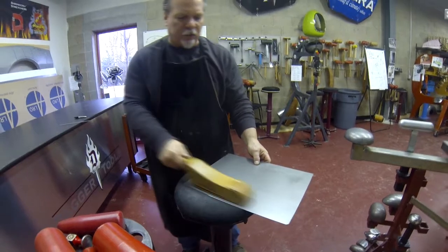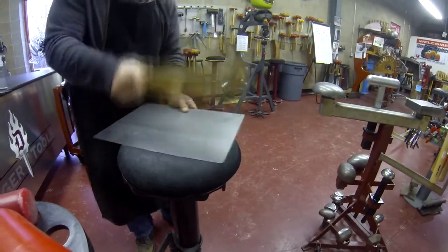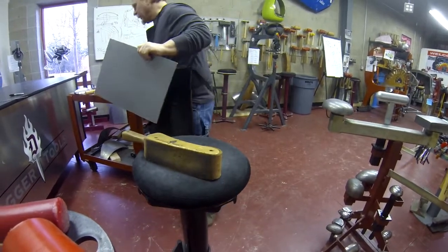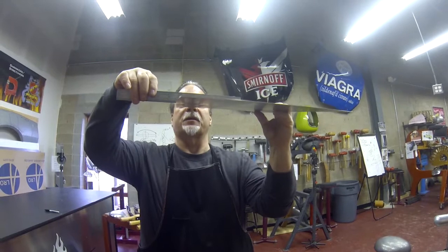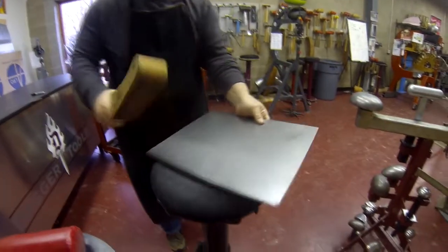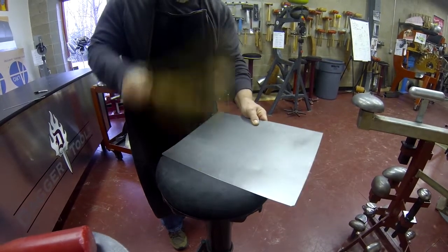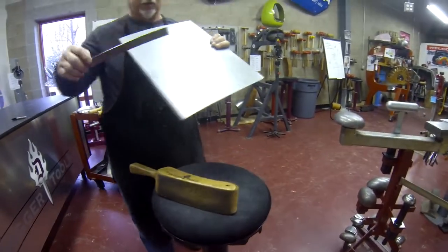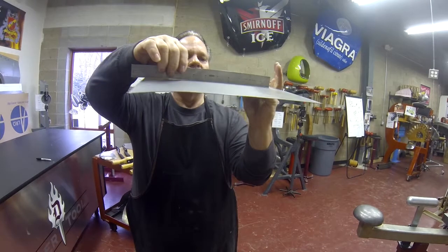Primarily, how frequently and how uniform the blow surfaces are is what's going to give us the amount of shape introduced into the panel. We should be able to see even at this point some small changes going on in the panel — we can start to see how we've introduced some shape in there very subtly. By becoming more aggressive on the surface and increasing the blow force or frequency of the blows, we can begin to see how much more shape has been introduced from our original flat panel.